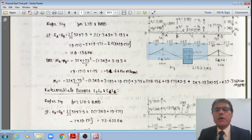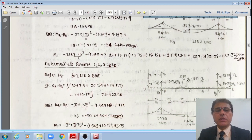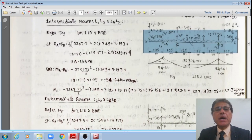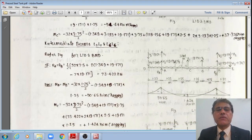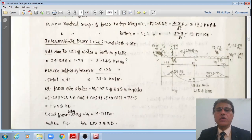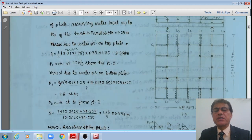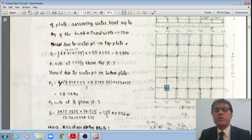And that is how the bending moment distribution diagram looks, students, for this loading diagram of this girder L3, L3, or because of mirror image L5, L5. Once you understand that, in a similar fashion, now we will do the analysis of intermediate beams L2, L2, L6, L6. Right? I will go to those beams at which I do have one V2 downward, one V2 upward, and also V2 upward from the transverse direction,